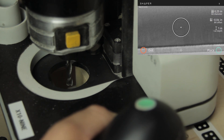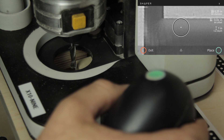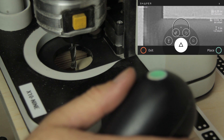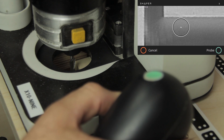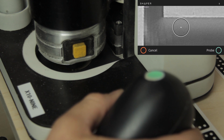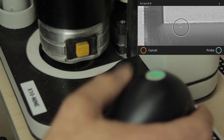We've got it aligned at 90 degrees to us. What we're going to do is use the bit itself to probe the edges and define a line, which will be our X axis. I'm going to plunge down here a full rotation of the cutting flute so that we get an accurate circular reading about how far off center we are. We're going to use the top of the flute to just push it against the surface, not applying any pressure, just touching, and then probe that.